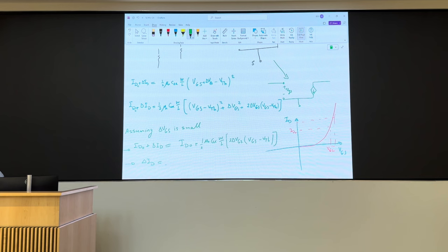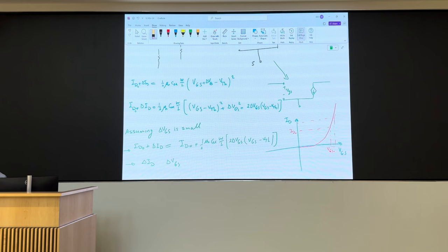And I'm going to say approximately, right? Because I'm making an assumption. I'm ignoring that delta VGS squared term. Delta ID is approximately mu n Cox W over L times VGS minus VTH times delta VGS. And this VGS is VGS naught. This is my DC. This is the starting point. So put VGS naught.